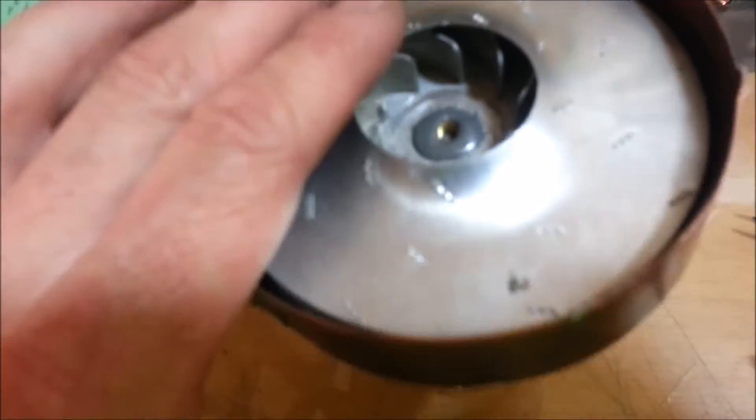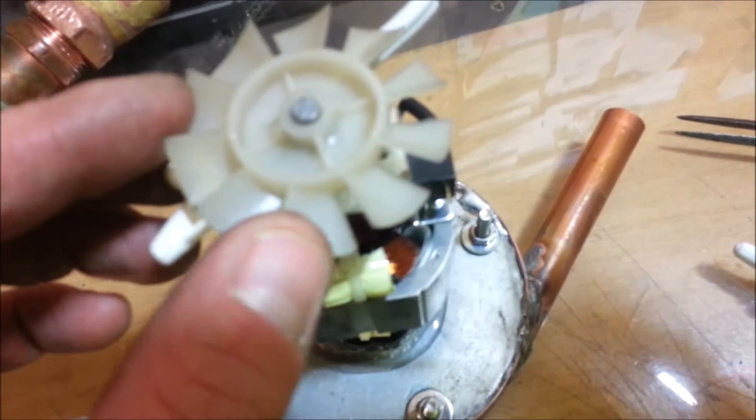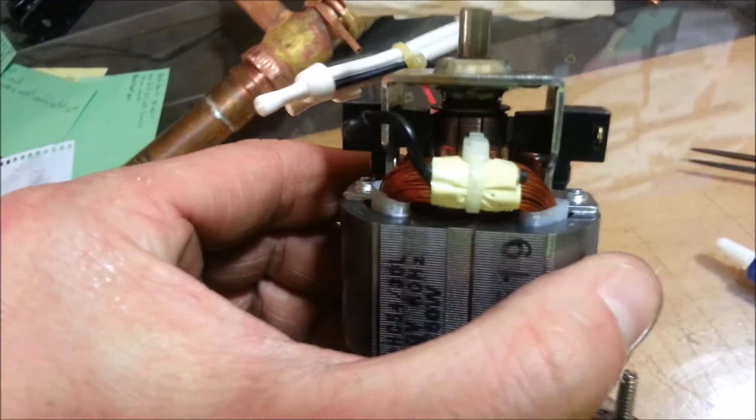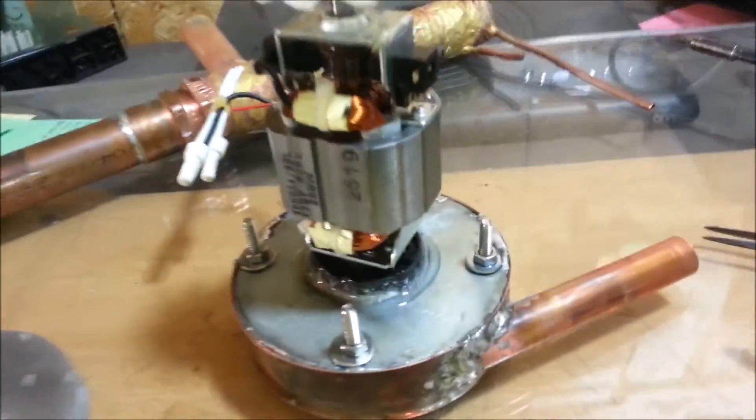Here's the blower that I'm building for this device. I got this nice little rotor out of a vacuum cleaner, but the blower housing was not acceptable, so I had to build this thing unfortunately. According to the direction of this propeller, it should spin the right way. I did jump the gun a little bit and go ahead and build this before I tested the direction, but I know how to reverse direction on these universal motors — you simply redirect the way the power is routed directly to the motor. I scored a free blower — this came off a free vacuum cleaner, and this came off a small blender for nutrition shakes.